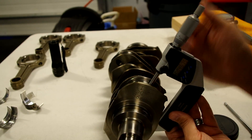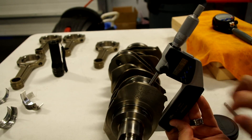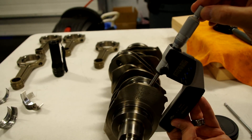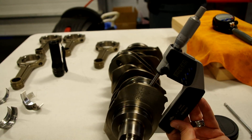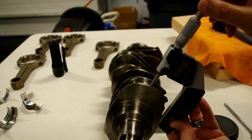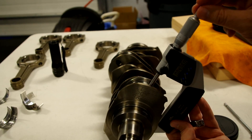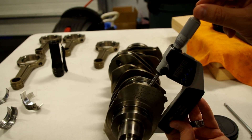Personally, I find this method not to be great. I think it would be better if there were an adjustable stop coming out of here with a flat surface so you could verify you're right along the center line, as opposed to this freeform approach. You can kind of feel when it's close — there it is again at 4680, pretty consistent. But it never gives me a great feeling that it's always that accurate, especially down to ten-thousandths. I'm sure there are more professional tools for measuring outside diameters. But it does work pretty consistently, so I shouldn't complain too much.